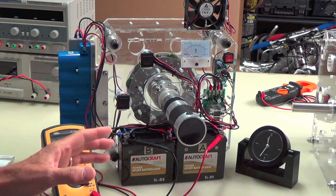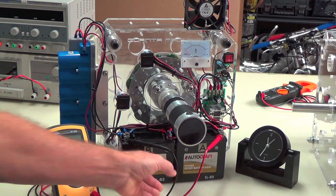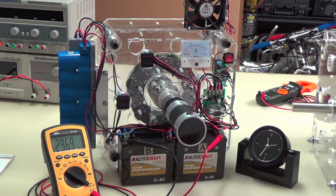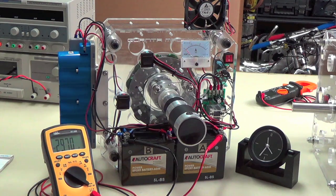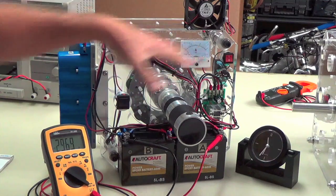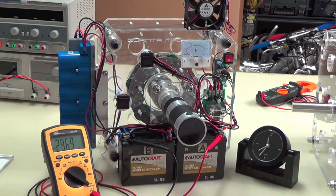But it's interesting because this process is kind of a use it or lose it type of process. These batteries don't want to have a standing voltage of any more than 13.1 or 13.2 volts. So what they're going to do with this 14.8 or more is actually dissipate that over time. Say 24 to 36 hours, you're going to see all this just dissipate, especially out of the caps, going back into the batteries, and the risen voltage in the batteries, all going to come back down to exactly where you started, or maybe just a little bit more.